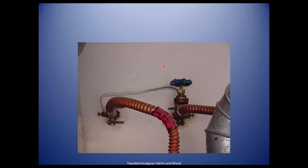Why is this bonding jumper here? Because you have two pipes going into a water heater and you have to connect them — they're bonded together. At the water heater where you have a dielectric union, electricity can't travel down that from hot to cold 99% of the time, because the dielectric is an insulator. That's why this is supposed to be there. If you put it in and have copper behind the wall, then you're bonding the pipes correctly.